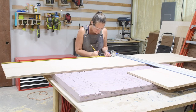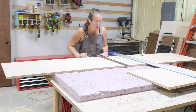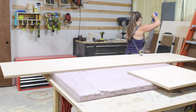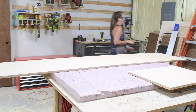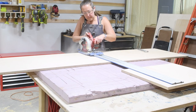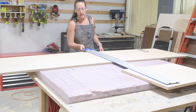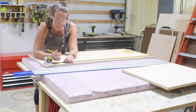I'm going to use edge banding on the plywood edges for a nice clean finish, and we're basically building another U shape. I've set up my workstation for cutting plywood. One of the easiest ways I break down plywood on my own is on a piece of two-inch rigid foam. The foam fully supports the entire piece as I make smaller cuts, and it acts as a non-skid surface so the plywood doesn't move around. One of my favorite tools for breaking down plywood is the Kreg AccuCut — it makes cutting plywood without help really easy.